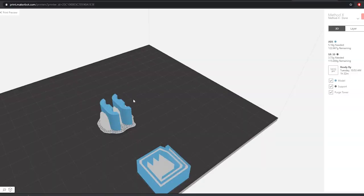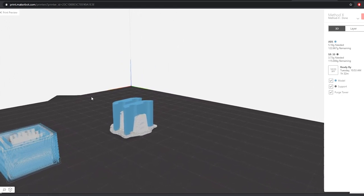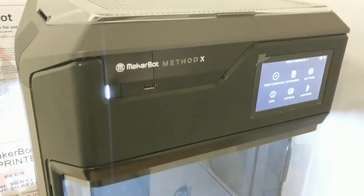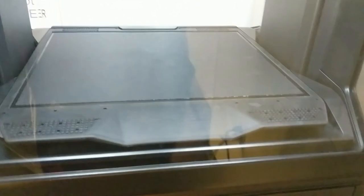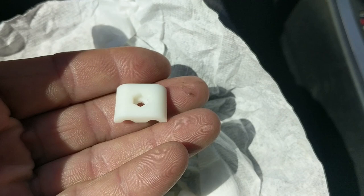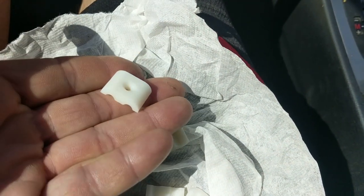Here's a real quick overview of the 3D printing process. My parts are shown here in blue and the white stuff around it is called support material - it kind of builds up like an anthill, keeps the part dimensionally stable during printing and also keeps the holes from collapsing internally. Then it goes into the 3D printer. This is not a home-desktop style printer - this is a high-end 3D printer, it's temperature controlled, very very accurate. Once the parts are printed they go into this bath and that dissolves all of that support material, so you end up with just clean parts. I'm going to put these parts on a website called Shapeways - anyone who wants to order them can. They are not just models; these are structurally strong parts made of solid ABS.